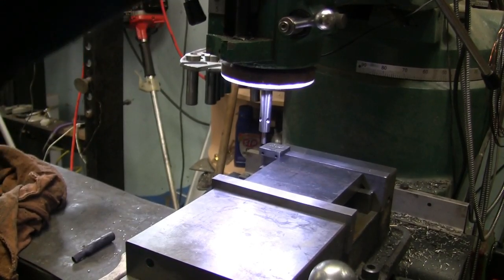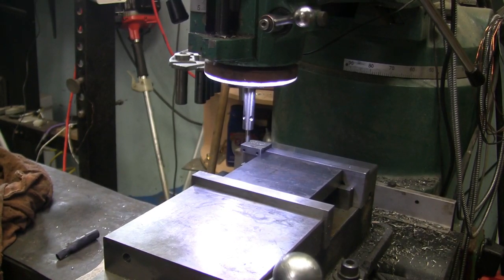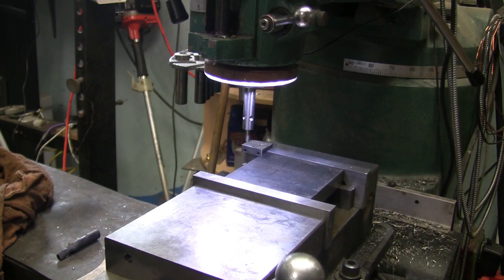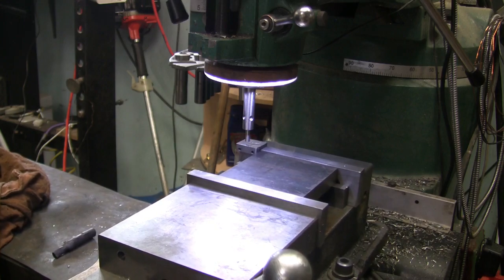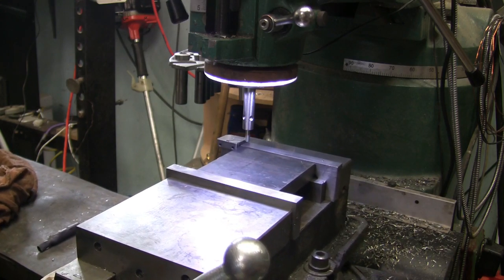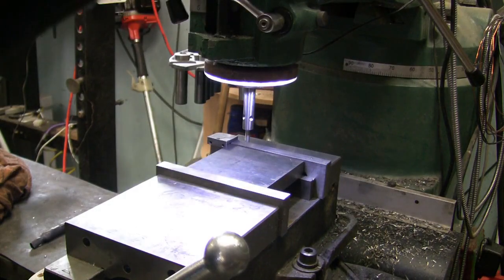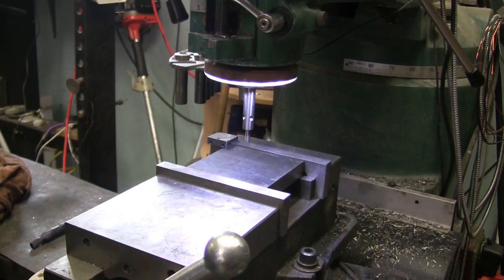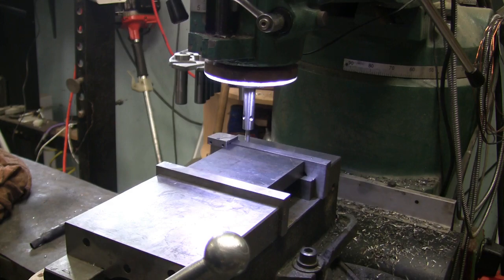All right, 0x. Whoop. 100. Or 1" 900, whichever. But I'm just going to go 100. 0 it, and then go to 2 inches. And I'm going to lock the table at 2 inches. So I got my X and Y lock. I'm going to zero that out. And I'm going to go check on my saw. I'll be back when I'm putting a tool holder in, a drill chuck in.